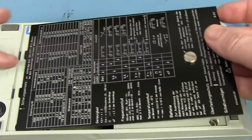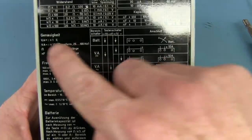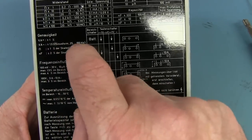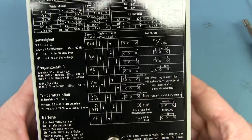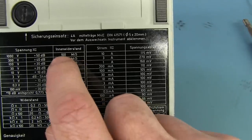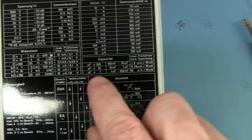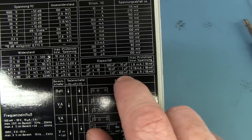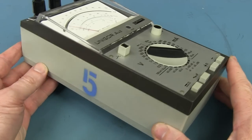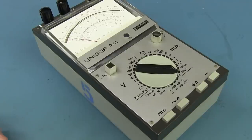Let's check if it's still within spec. If you change the orientation of these things you should tweak the zero — there we go. Zeroed that and plug it in. Pretty close! You've got to get the mirror there to avoid parallax error, but I think it's pretty close. That's as close to bang on as you can get — there's a needle width in that. Unbelievable! This is a beauty! The good thing about analogue meters is that you don't need the battery to read DC volts — you only need it for the ohms range and in this case the capacitance range.